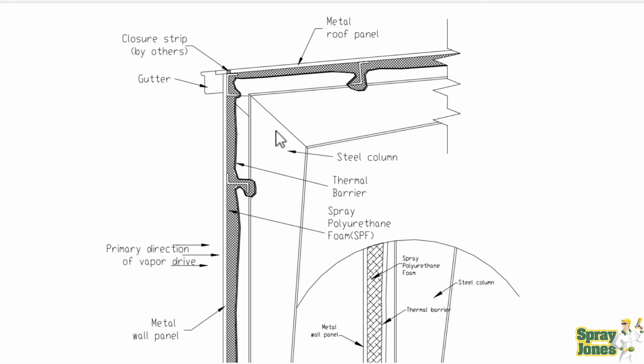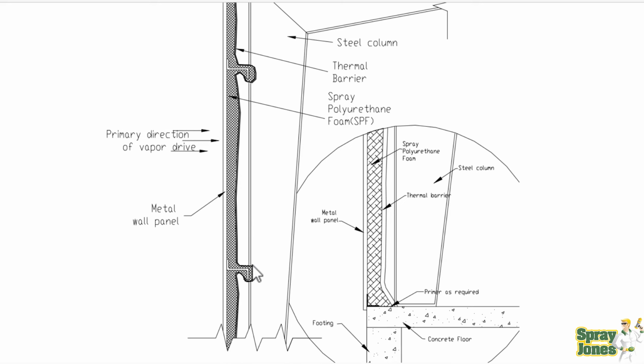So here you have your metal superstructure, right? This is your structural column and beams. And then the Z-girts are mounted off of that, and then the siding. I keep calling them Z-girts, but they're purlins, metal purlins, running horizontally every 2 feet or every 4 feet, depending on what the spacing is. What we have found is that when this flange is fully embedded, and I'll zoom in so you can see.